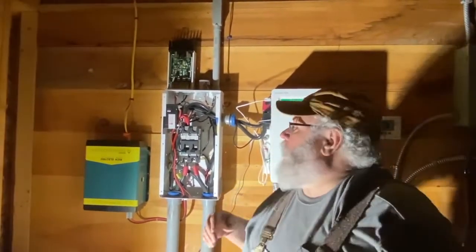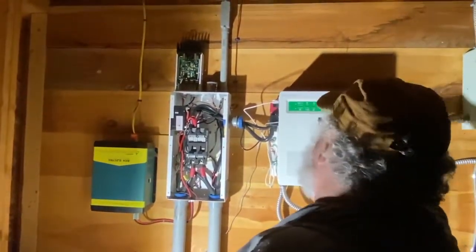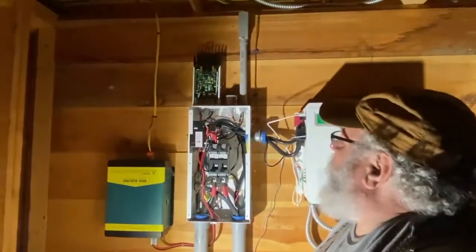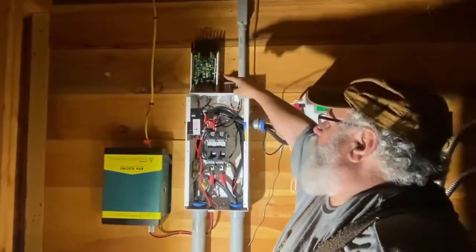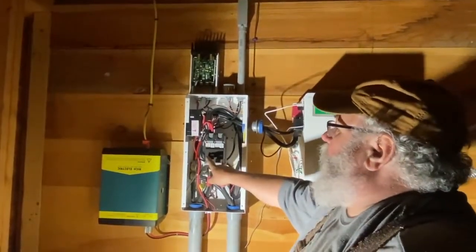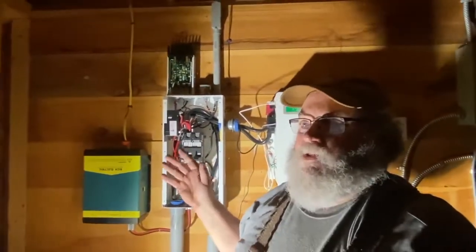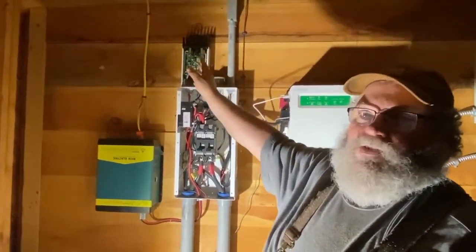Here we are — it's like 6:30 in the morning. I just got home from work. I've got everything turned off: both inverters, as you can see, are completely dead. Everything's blacked out. This is the main — the power coming out of the battery box. And then we've got the array, which is the power coming from the panels going through the charge controller into the batteries and out. I've disconnected the output power and the input power, so it's effectively dead. I've let that sit for 10 minutes, which drains all the voltage in the capacitors stored up here. That's how Xantrex says you can reset the whole thing.